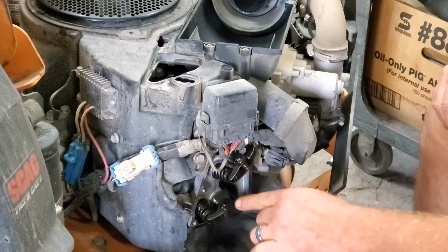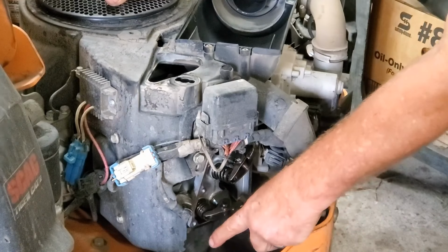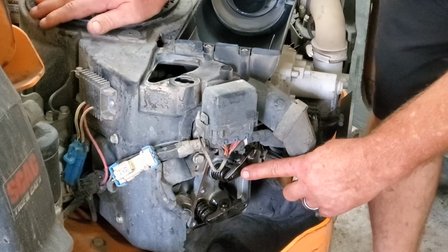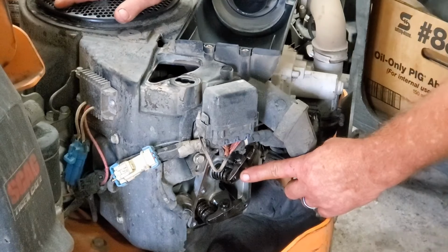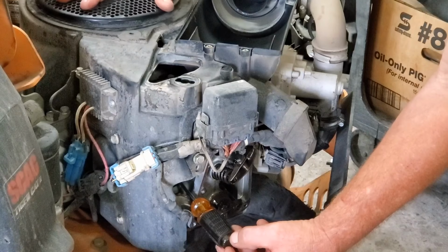This is our intake valve, this is our exhaust valve. So intake valve, it's on compression stroke right now. I'm going to turn it by hand. Piston going out. All right, now we're exhaust. Okay, now next thing, we are sucking in fuel. Intake valve is open. Now the next step is going to be compressing. Okay, valve coming closed. You can take a screwdriver, and don't be forceful.